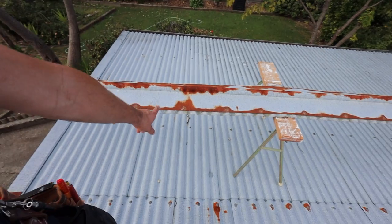Down here where the roof gets flat, I definitely have to go horizontal. I'm getting away with vertical up here because the roof is on an angle, so the chances of water tracking in sideways are less. And as long as I paint this roof nicely and get it all sealed, I should be good.